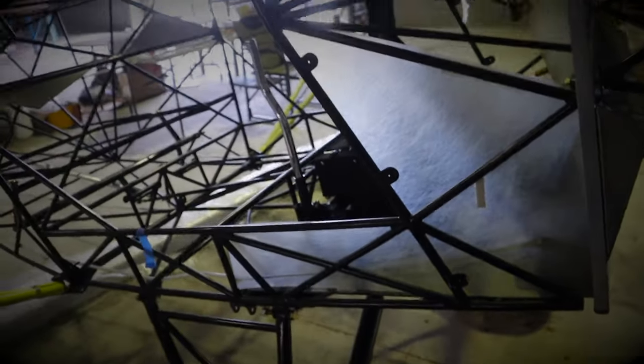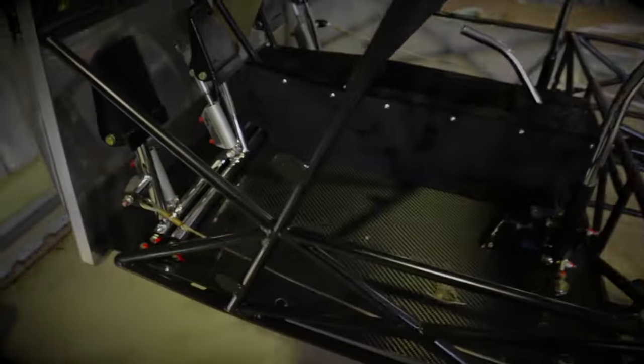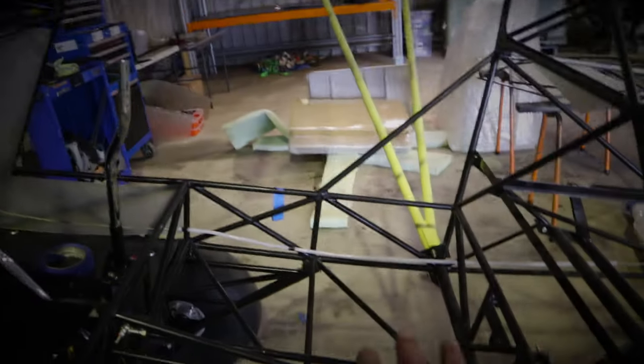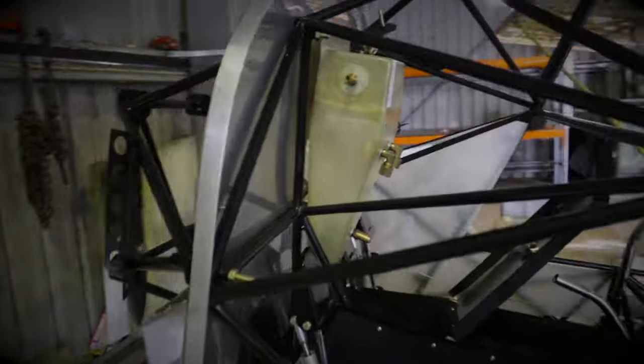There are these fiberglass insert kick panels — they are installed on the inside of the airframe. They come from the factory just like that, with quality stamps. They come in the kit and fit in their first go. I have the other side taken out because I've been working on it. It was very easy to install. That sort of forms the interior, and then the seat pan will obviously go in here. Cockpit panel, glare shield — and all of a sudden it becomes pretty complete.